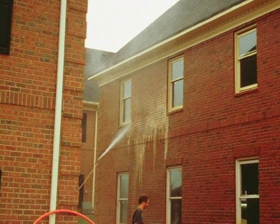It's commonly used because notice how this illustrates that the cleaner can stand on the ground, and by just adding extensions to the wand that he's using, he can clean brickwork 10, 15, 20 feet in the air without a scaffold. So the mason likes it. He can come, lay the brick, tear down his scaffold, and get his equipment off-site, off to the next job, and then the cleaner comes in and just standing on the ground can clean the brick.